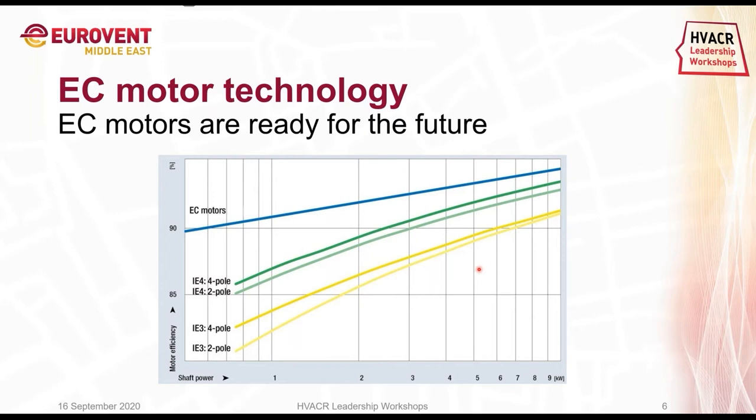Looking at where EC motors are at the moment, I made a comparison between the kilowatts and the motor efficiencies, combining the IE3, IE4 and the EC motors. What you can see here, the previous IE3 motors, the yellow line, where we reached a certain efficiency on the 2 and the 4 pole. At this moment, we are using IE4 motors with the 2 and the 4 pole. And you see that EC motors in general are quite above the green line. So we can say that we are ready for the future in this.